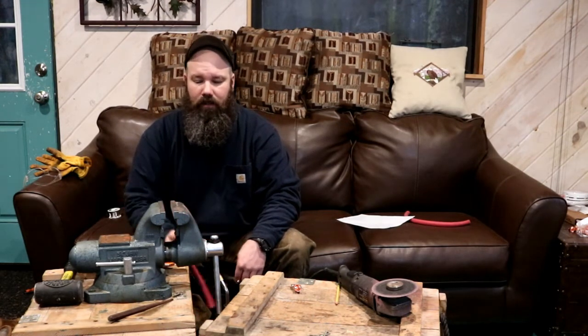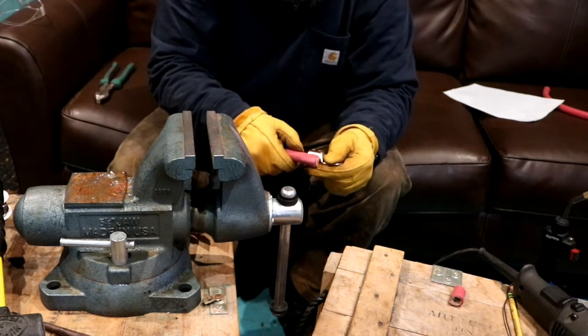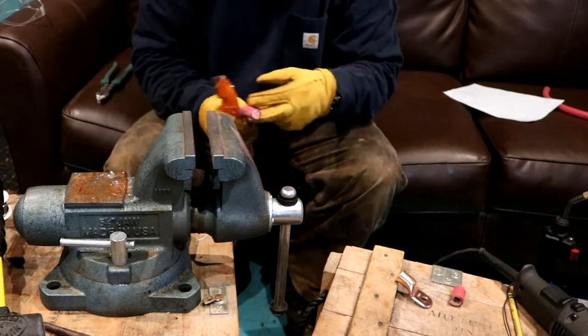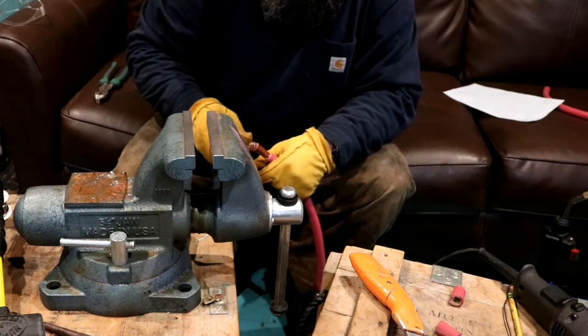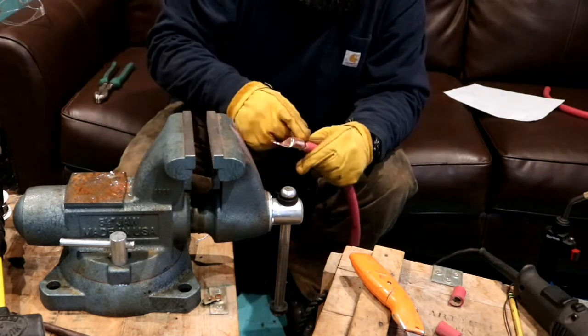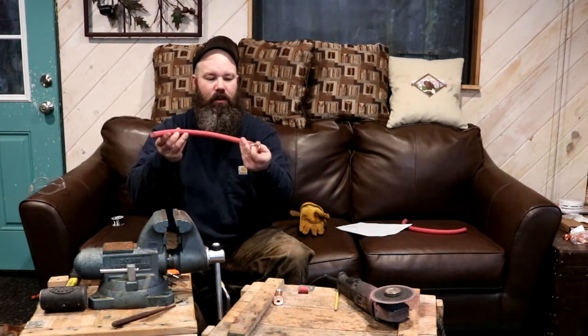They definitely aren't going to come off with this technique. We take the cap, line it up where it's going to sit flush and get seated, then cut a quarter inch past that. Set the cap in there — it's alright to have some exposed wire. You can put some heat shrink on it, or I'm just going to put some electrical tape on it. Then seat them the way they're going to lay. If the natural curvature of the wire goes one way, seat it that way so you don't have to re-curve it later. Let's solder this bad dog and then punch it.